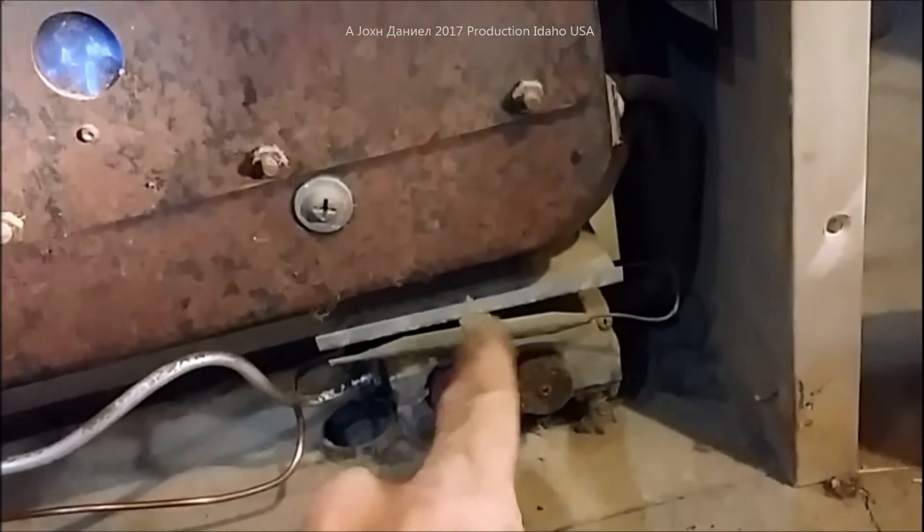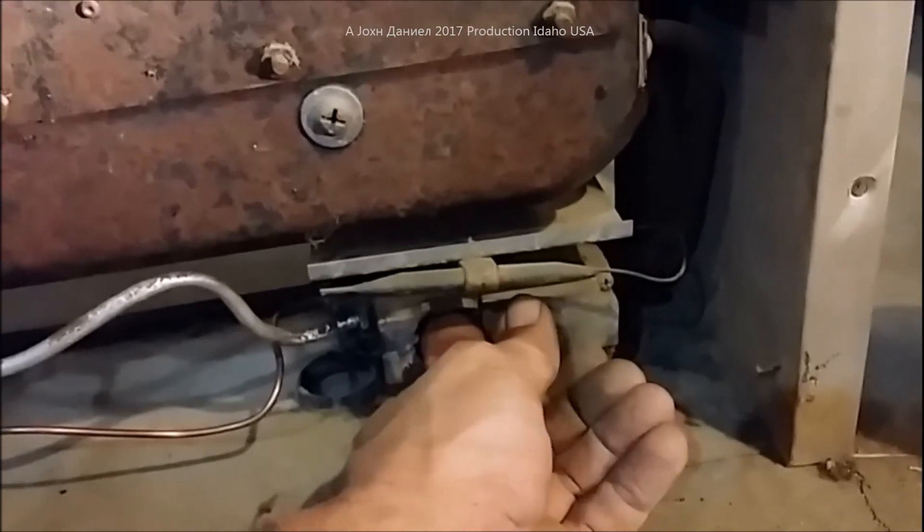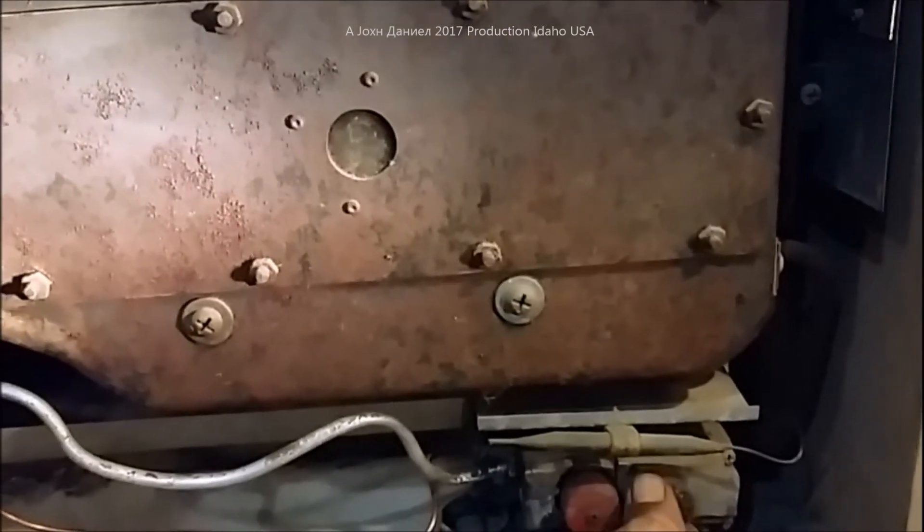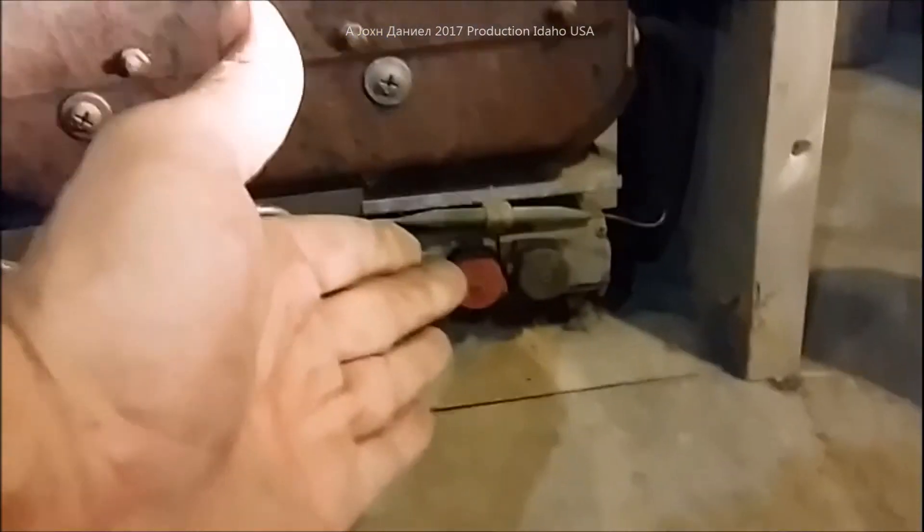That keeps the flame on through a capillary heat action effect, sending its temperature down to be sensed and keep the pilot flame on. This furnace works via snap-action hydraulic off the bulb - we'll kick up the heat and there it's burning. It's an old beast but these are very good. I looked inside with a borescope camera and there's no scale or damage inside. Watch - I'll turn this one down and the fire goes off, back on and the fire comes on. Very unique, very old-style valve using hydraulics.